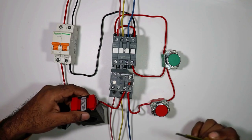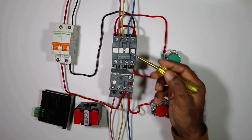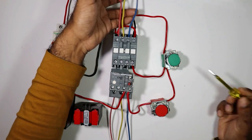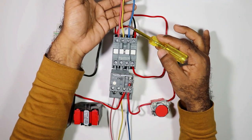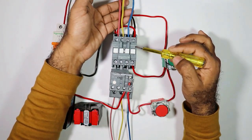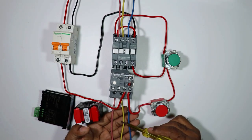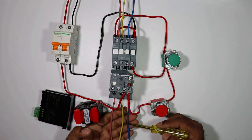Whatever is the power wiring of the motor - you can see here this contactor has three phase power supply provided to it. This red, yellow and blue wire - these three wires are of the incoming three phase power supply. After this when we turn on the contactor, the three phase power supply starts receiving here, and you can see that for the motor three wires are connected here.